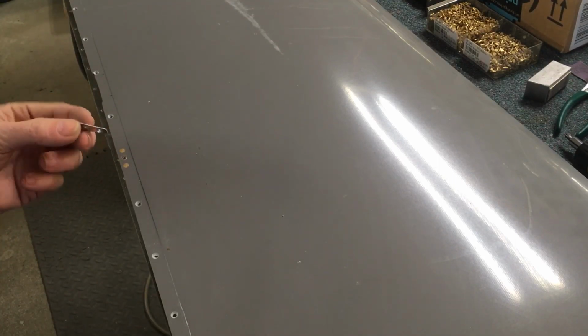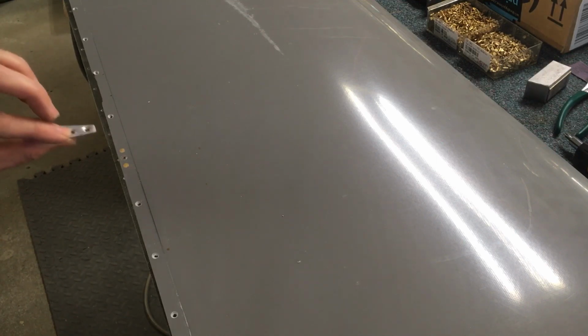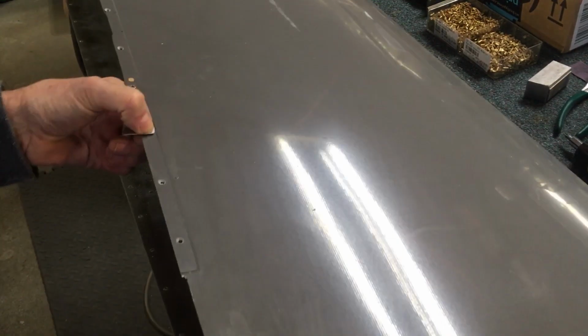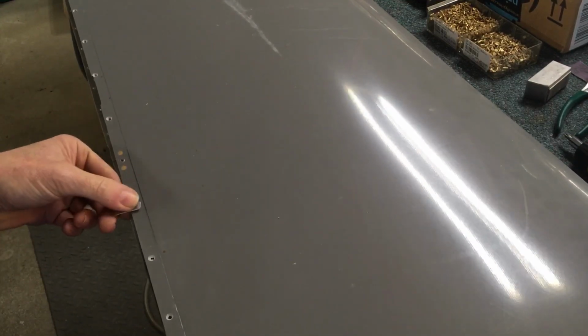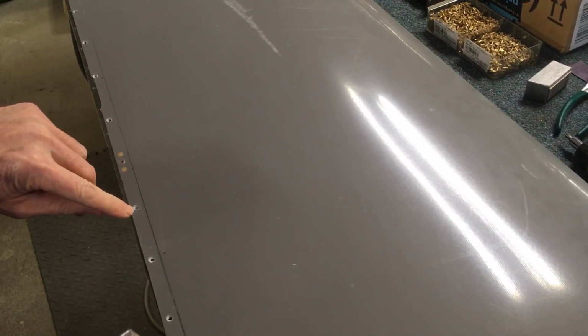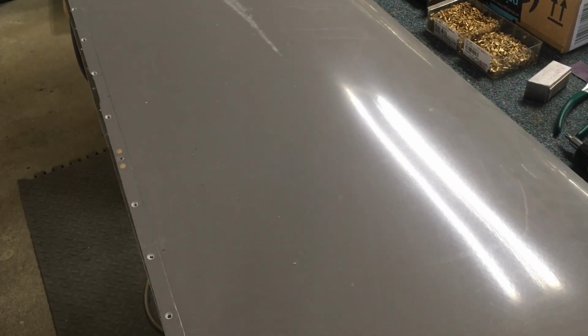This is the same thickness of skin as the wing skin with a dimple for that screw head. And then you want to try it in here and see. So you can see here that this is way too big to fit the countersink, because I haven't done them yet. This is still small enough. Initially I want the screw to fit that, not the dimple, because I want the screw to center up so it holds the nut plate in the center.